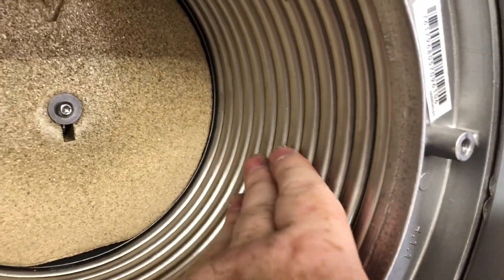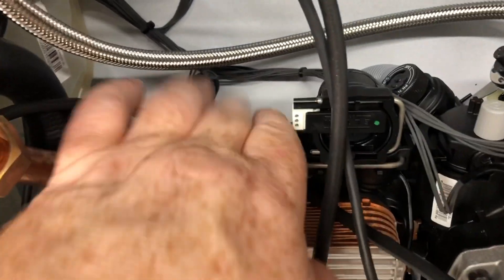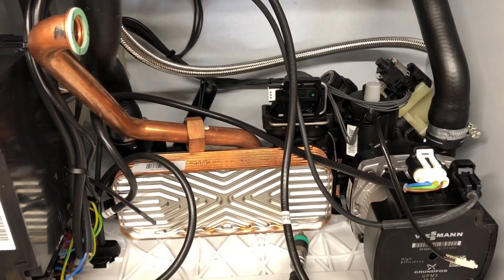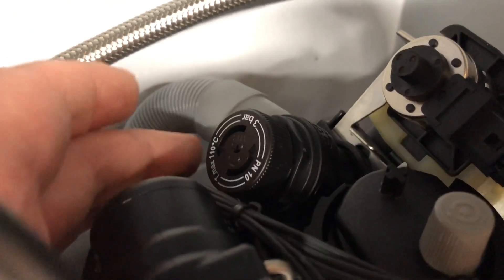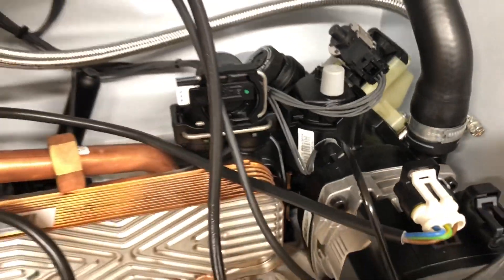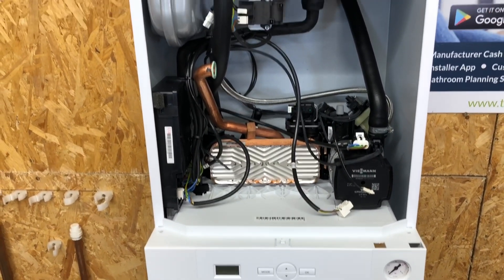When we look inside, we can see the Viessmann heat exchanger. There are plastic or composite components in the boiler, but it has got the built-in shock arrestor. Personally I've never had an issue and I've never known of an issue with the plastic components in a Viessmann - please put a comment below if you have. A really good thing is the blow-off or PRV (pressure relief valve) is built in, so you do not need to run a PRV pipe to the outside. There's also an auto air vent. It's also got rubber hoses in this model - remember this is the budget boiler; the new 100 has copper pipes inside.